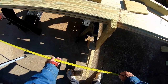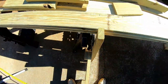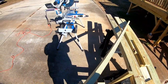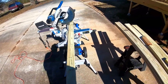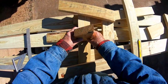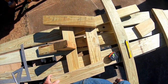That way when I put a five-foot piece on top, it'll come out even, and then if I decide to add some armrests on my bench I still have room to do it. So we need to cut our first board — good thing I saved one good 2x4. I think before I do a sink I'll have to go buy some more lumber. Let's cut this 54 inches. I've marked the middle of the bottom board where I want to attach the 2x4 — basically like that — and we'll put it in there as square as we can get it and attach it on the other end.